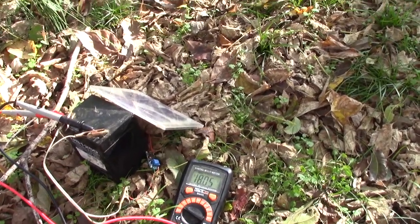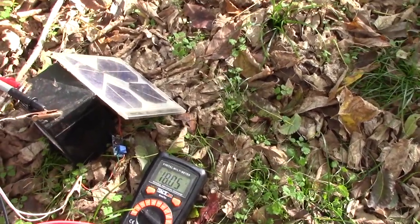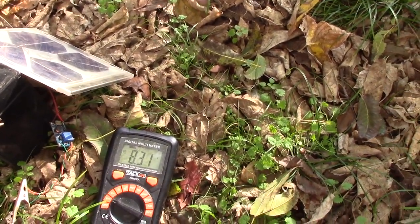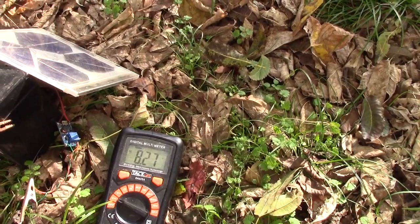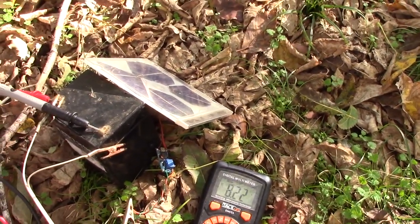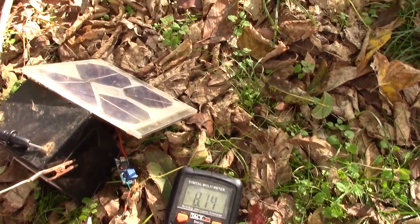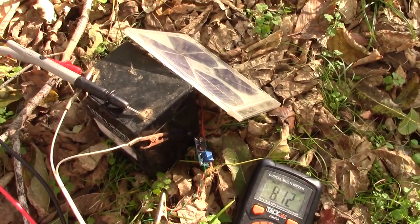I've had this running for the past few minutes and you can see the sun's not really hitting it now, but anything above that 6-point-whatever would be a win, wouldn't it? So I'll disconnect the charge. There we are — 8.3 volts, just from those few minutes, and it's not coming down very fast either. So I'd call that a win as well, and I'll do some more experiments with this. Perhaps try and get this battery up to a decent voltage. It does work — we basically got a 2 volt panel charging a 12 volt battery.